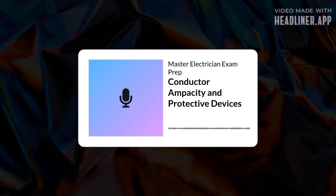Same limits apply to the equivalent aluminum sizes too, like 12 AWG aluminum for 15A, 10 AWG aluminum for 25A based on its ampacity. You can't put a 20 amp breaker on a 14 AWG wire circuit just because the wire is rated 90 degrees, the ampacity might be higher. Okay, hard limits: 15A for 14 AWG, 20A for 12 AWG, 30A for 10 AWG. Good to remember. Absolutely.